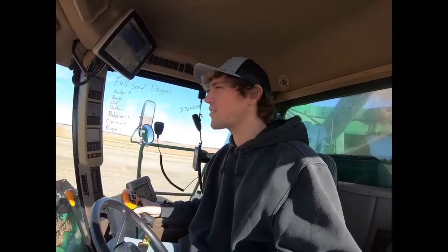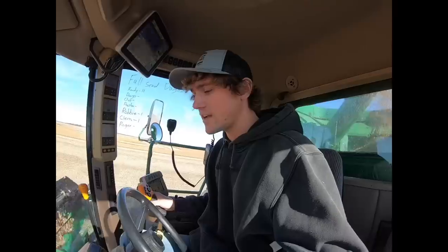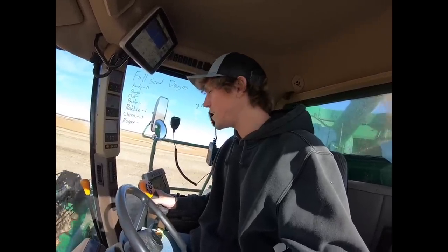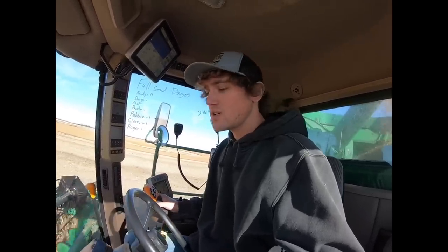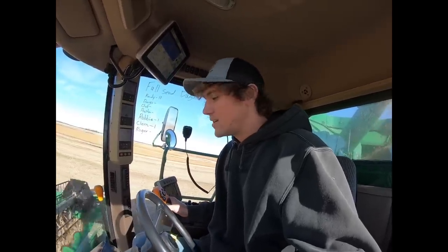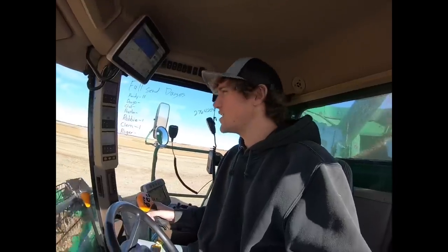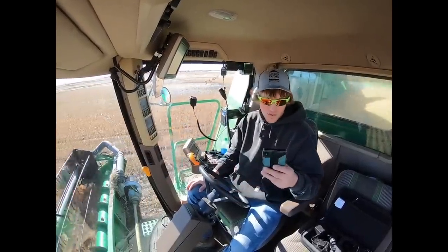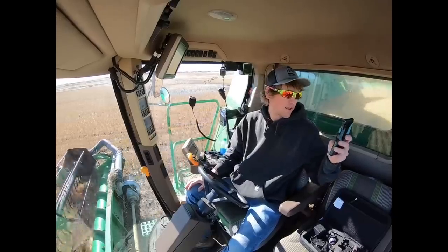Ridges, 4-6 inch ridges, so you gotta constantly be looking for those, especially on the headlands. And then your cutter bar cuts into that, gets big, huge chunks of mud on the cutter bar so it won't feed, so you get to get out, clean it off all the time. It's really an efficiency killer. It's wet out here. Oh man.